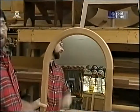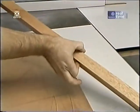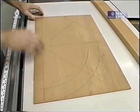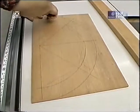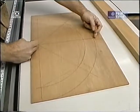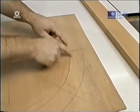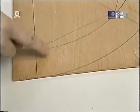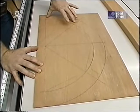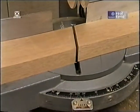To add a little elegance to the mirror I decided to do an arched top — it looks difficult but it's not bad. The stock I'm using for the frame is one and an eighth inch thick mahogany. I made a template from a quarter inch plywood with the inside and outside radius of the arch laid out. I could cut this arch from one 12-inch wide piece, but that would be wasteful, and the grain becomes perpendicular to the length of the arch near the ears — very weak. So traditionally arches like this were made from several glued-up pieces.